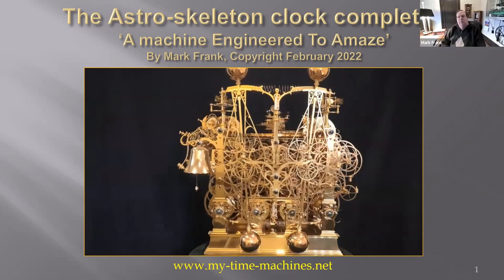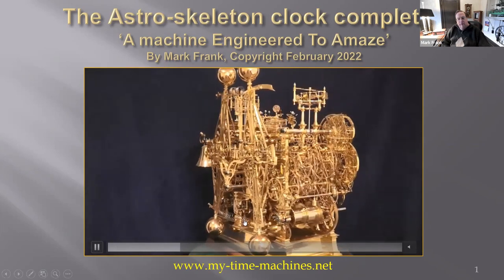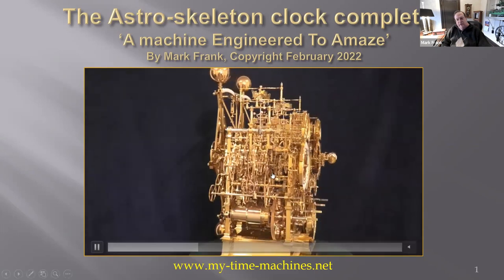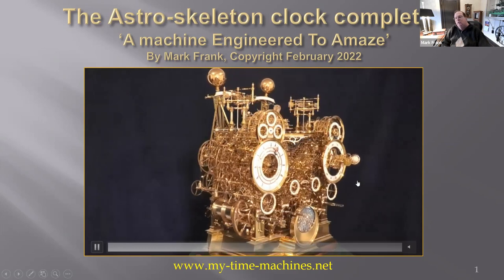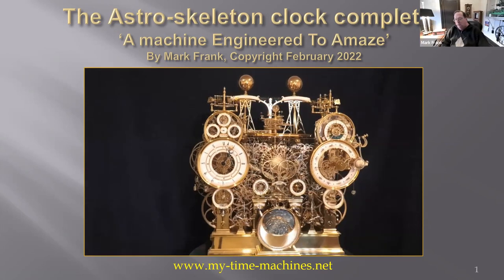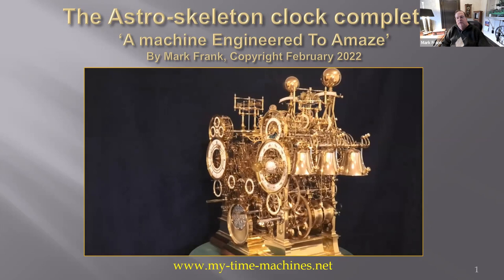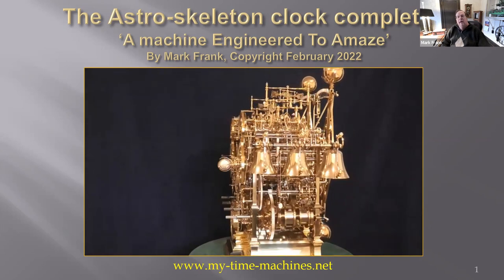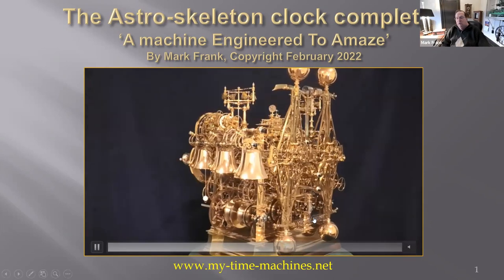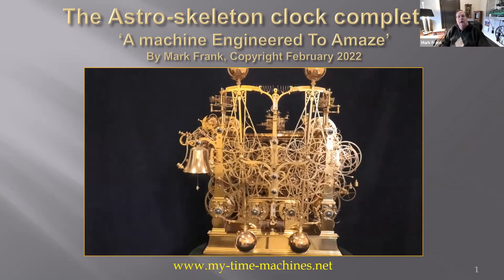Now these springs here are a special material that does not change. It's not Invar. It's another one that they use in balance springs in watches. Invar is for pendulums. The other one is for springs. When we originally fitted this out, it had just regular steel springs. And we were talking 15, 20 minutes variation a week on it. So that helped it a lot.